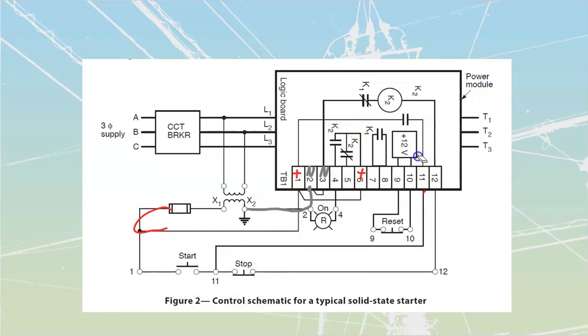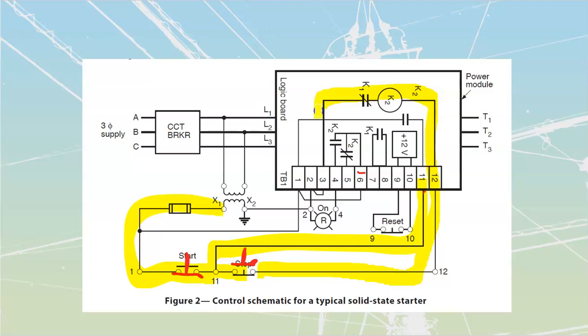Change that around in your books. Then you can follow it through, and you'll see it acts the same as any other regular stop-start system — stop is normally closed, start is normally open. From there you've got this tied to a normally open here. When you press start, it provides power all the way through the K2 contactor back to neutral. When K2 closes in, it closes in the seal contacts, which seals the circuit in. Not a common scenario externally — far more common is just that single stinger with a single device.